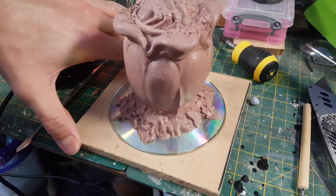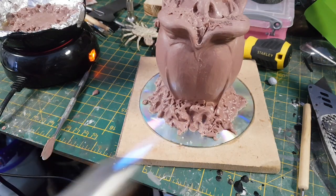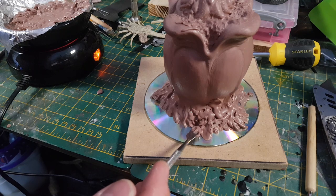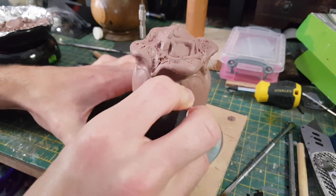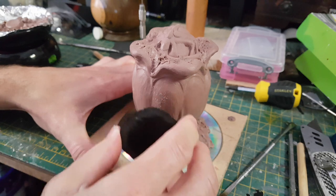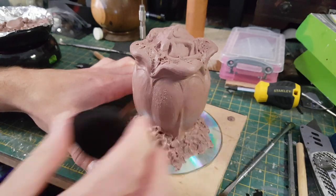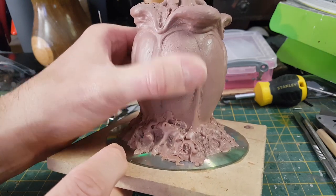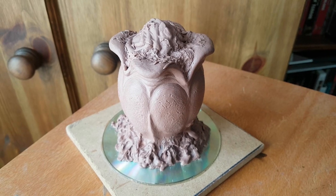For the base I've put in some random organic shapes and I'm now coming in with the blowtorch directly to melt the clay, and also adding more molten clay from my wax melter. I also need some skin texture on my egg, so I'm using a texture stamp I made a while back — there's a separate video on my channel where I poured resin into some orange peel to pick up the texture. I'm pressing that into my sculpture. The texture was quite sharp initially but handling the egg smoothed it out nicely. I've also cut in some skin wrinkles with a sharp sculpting tool and gone over those with some white spirit to smooth them out.